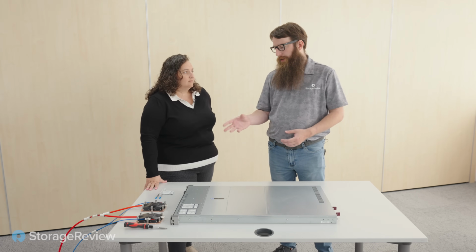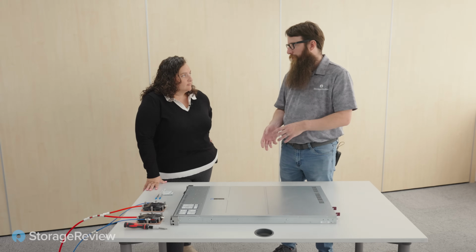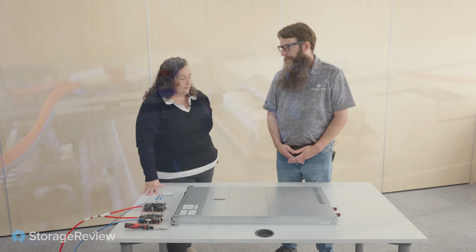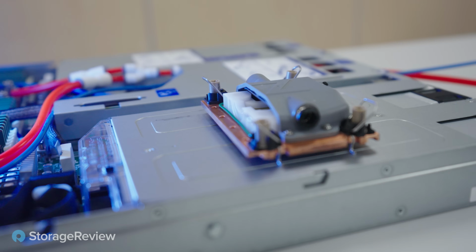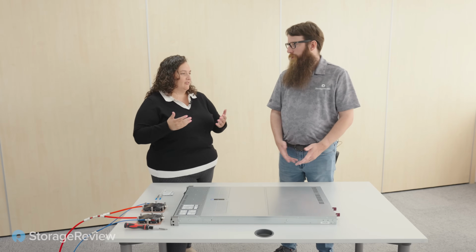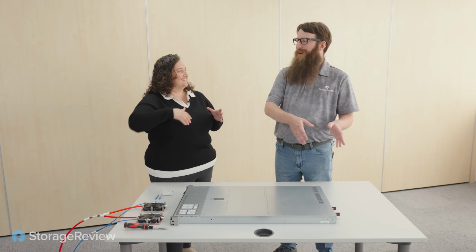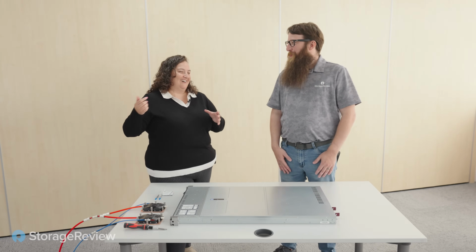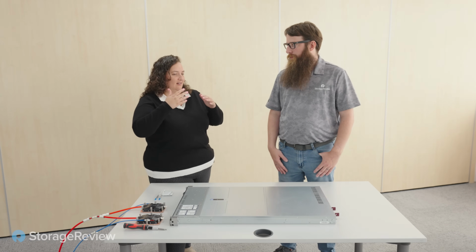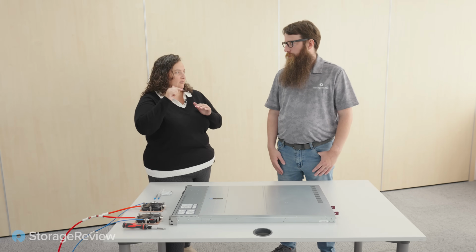Okay, so what's going on inside that cold plate though? How does it know how much fluid it needs? Is there a flow rate measurement? Is it run by the CDU? What's going on there? So each one of our evaporators has an on-demand float inside. The idea is just like a carburetor float, or even one you find in your toilet. Liquid goes in. If there is no load, the liquid fills up the evaporator. The float floats and shuts down the liquid inlet.